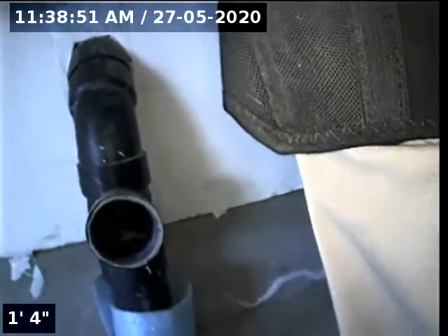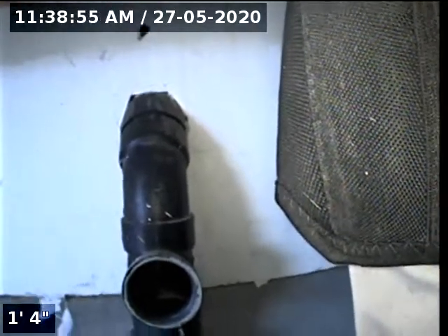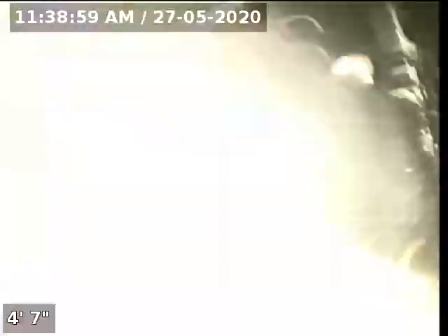The house is facing south. There's the south street, as you can see. I'm in your garage — there's your entry and all of your heater and everything like that. Here on this west wall is a 3-inch ABS clean-out. This will be accessing the line for inspection today. The purpose of this inspection is to determine the overall condition and serviceability of the sewer lateral for this property to the city main.